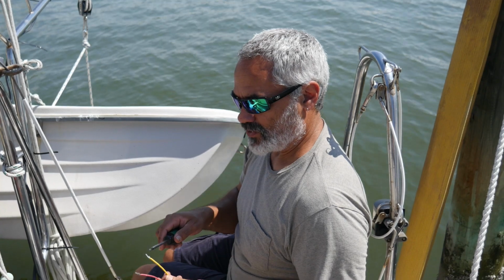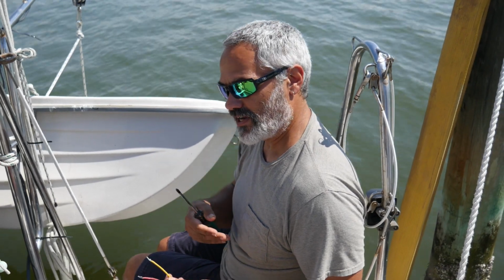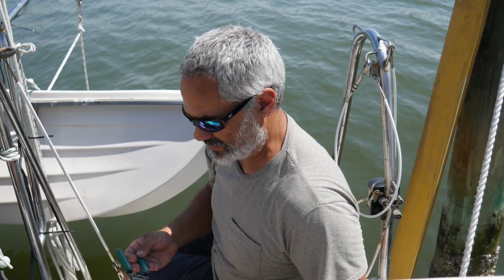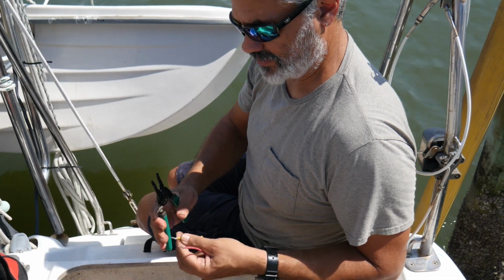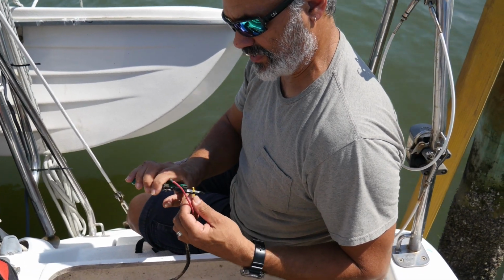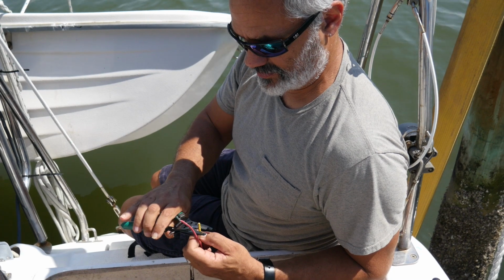But when you have corrosion on the outside of the wires, it resists the electricity, which creates heat, all kinds of issues. So anytime that I'm doing something like this, I will always cut the wire back to clean wire and re-strip it. And just one little tidbit, I always start too big, then move down to the next one.